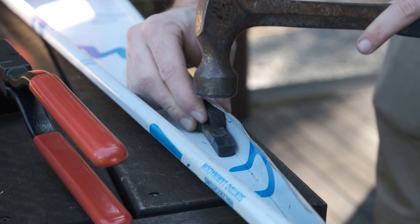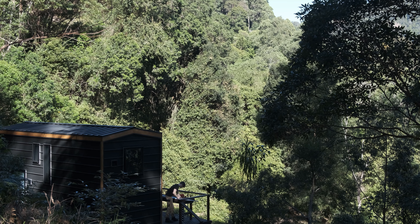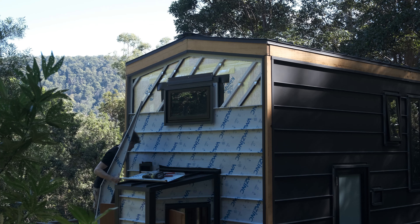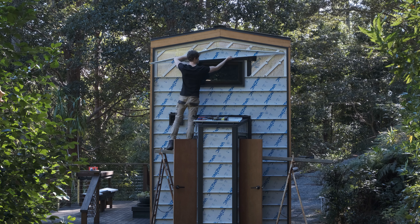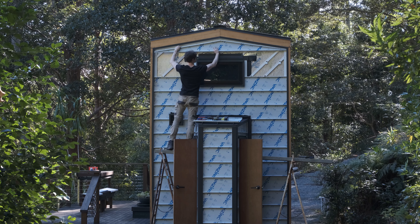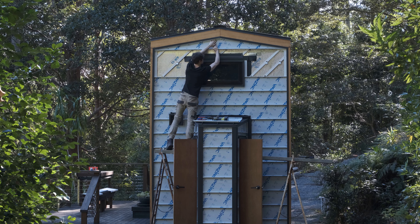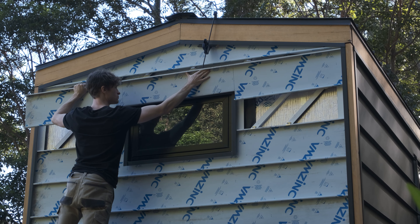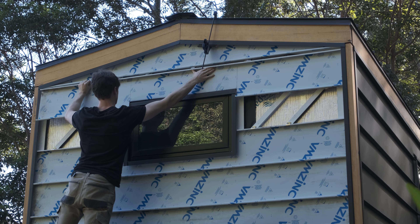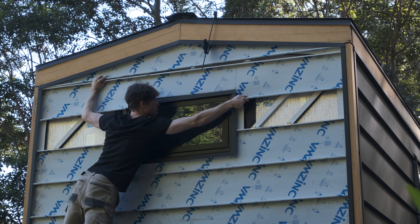This panel is still probably the one that requires the most custom work, as the whole top of it needs to be folded over to match the roof profile. The first fold was not so bad, but getting the second one took a bit of time with my hammer. I have to put the top panel in first as there is simply not the space to get it in otherwise. With this panel in place I can install the one that goes above the window — I just have to get the seams of this large panel behind the flashings to slide it into place, which is a little tough around the window by myself, but I got there in the end.